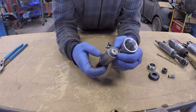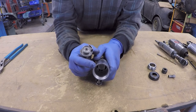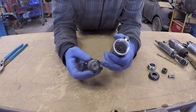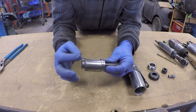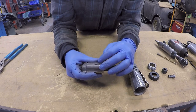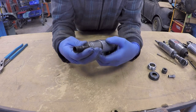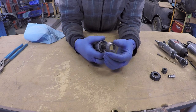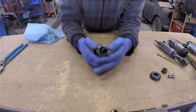The inlet for the motor is located at the bottom and the valve is located at the bottom. When you depress the valve, air comes out through the center hole in the body of the tool, enters in through the center hole in the back of the motor. As it passes through the motor it passes by some vanes, which causes the motor to rotate. The air exits through the front of the motor through these holes and passes out through the front of the tool. The retainer nut hole is a lot larger than the size of the shaft so that the air exiting through the front of the motor can come out through the front of the tool.